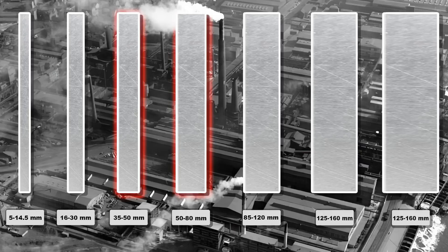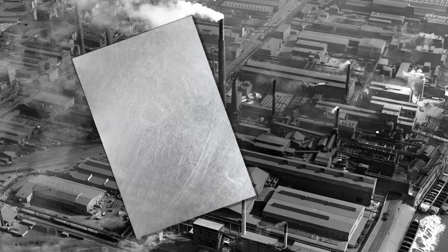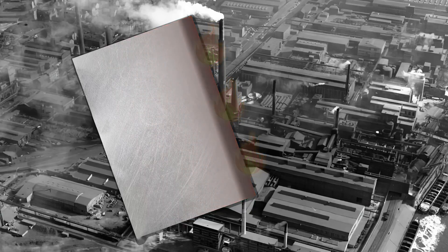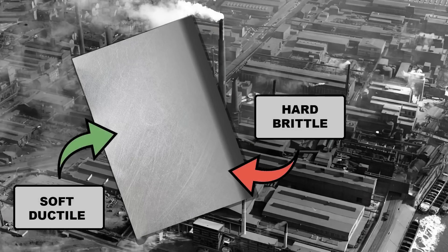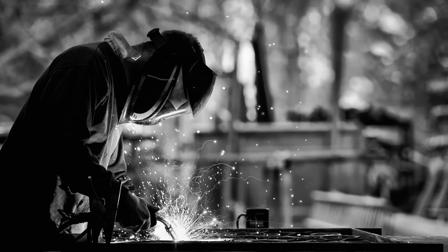The intermediary plates of armor in the 35 to 50 and 50 to 80 millimeter range are the most relevant to this discussion, as those involved surface treating to form heterogeneous armor. This would give the material both strong and ductile qualities — not something common in steel production — and by altering the crystal matrix to have a non-linear grain, this could be achieved. This surface-hardened armor was used notably on the Panther, Tiger, and Tiger II throughout the war up until late 1944.